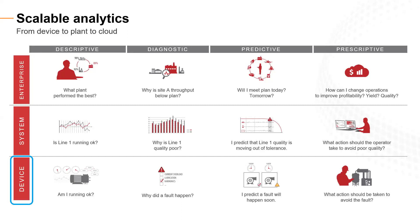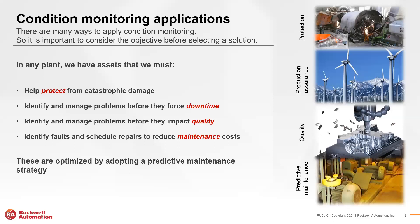The Dynamics 1444 system fits at the device level. Condition monitoring isn't just descriptive — it tells you whether vibration is too high and why specific faults are happening — but it also enters predictive and prescriptive phases by predicting when and how faults are propagating. From a high-level definition, condition monitoring means taking a closer look at key parameters, understanding how they change and propagate over time, and understanding how that impacts machine performance and health. Today's focus is on vibration condition monitoring specifically.